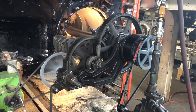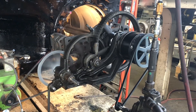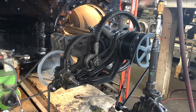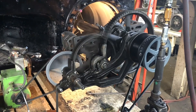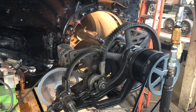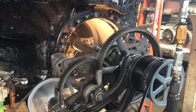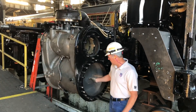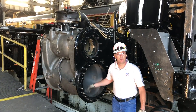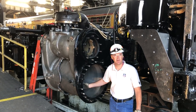In order to accomplish that, we built our 1930s Underwood Boring Fixture — a fascinating old machine. These big boring jobs require a really big, heavy-duty, rigid, stable tool fixture. In order to do that, we did rebuild this device. We were able to machine to the final dimension, just right around 24 inches, on these beautiful machine cylinder bores.